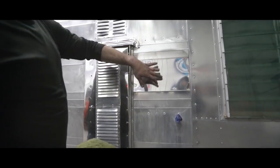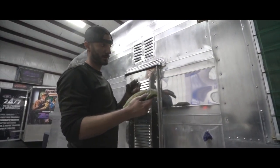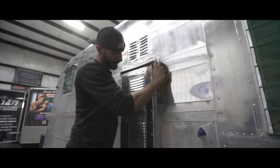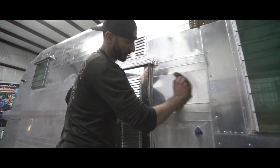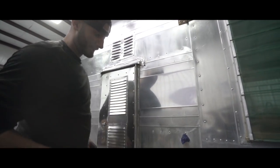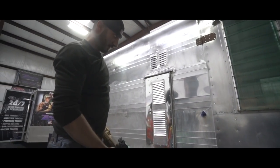Our primary cutting is done — we have a mirror image but it's not quite what we're looking for on a piece like this. We're going to take a rag with mineral spirits to get off all the Triple-E compound — it'll just dissolve that stuff and we don't want any cross-contamination when we switch to the joker pad and green moss compound. Just leave it on there, grab the green moss compound, put a little bit on the joker wheel, and add some color to it.